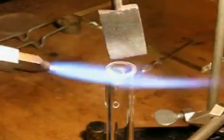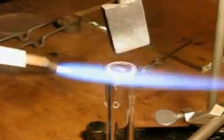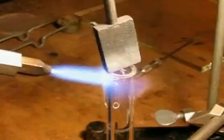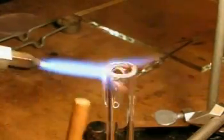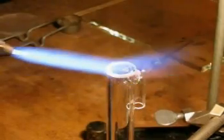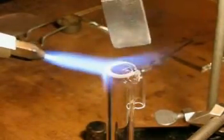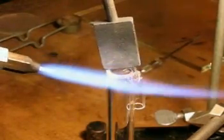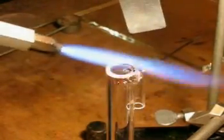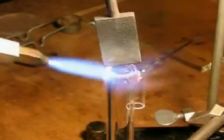The torch is used to keep the glass up to temperature, and working the fuse around using the carbon paddle to the place where the fuse was begun. The tube is rotated, and the carbon paddle gently presses down on the window to affect the seal, and it's chased around to the starting point.